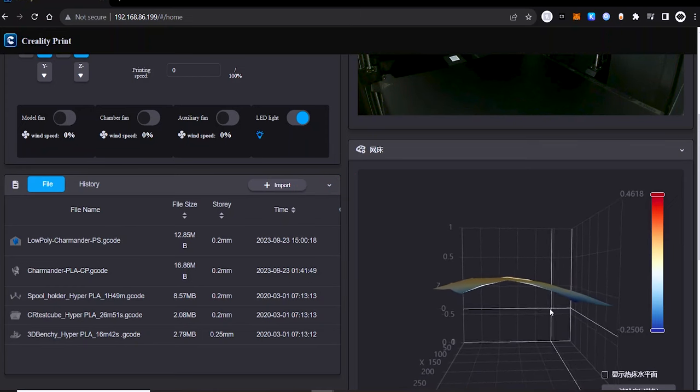On the touchscreen the small G-code thumbnail works but the larger one still doesn't — I'll have to look into that. With the PrusaSlicer G-code output everything appears to be going normally, except the big auxiliary side fan is not being used for part cooling as it was with the Creality Print version. Nonetheless the print finished in about two and a half hours, only a few minutes longer than the Creality Print version and slightly less than the PrusaSlicer estimate. The finished part looks almost identical, with just a few extra wisps of filament that needed cleaning up.